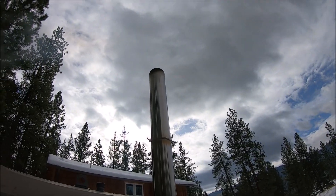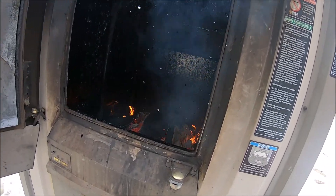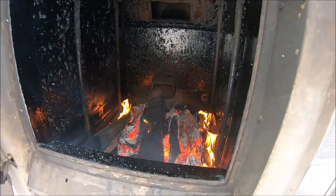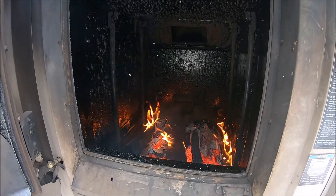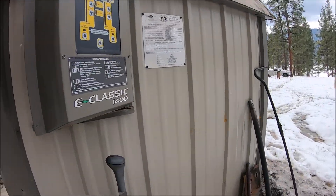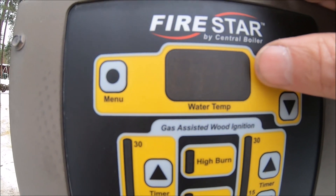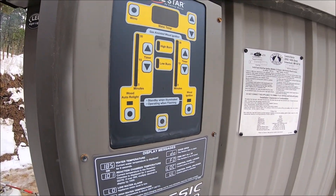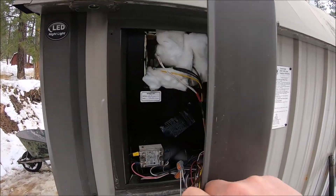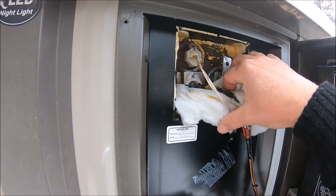So what I did is I opened up the back side here, got in here, and took the valve off so that air can get in here into the burner chamber. And as you can see it's smoking, so that means we got a fire going. It's just burning as a regular fire would in here without the blower blowing any air in. I had to do this so that we can keep the heat going in the house because we switched everything over to the boiler.